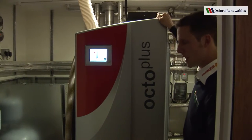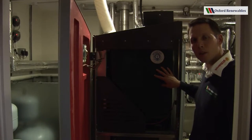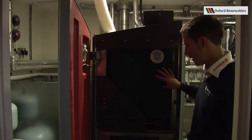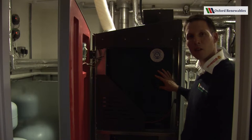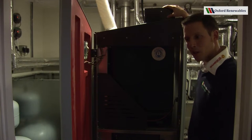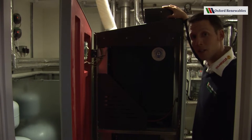The external door is one piece and by opening it we can see the internal hopper, which is the reservoir of fuel that the boiler uses whilst it's burning. It will never fill itself while it's burning. By turning on this vacuum turbine, which sounds very much like a hoover, it actually sucks the fuel into the machine.